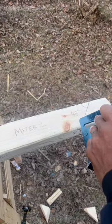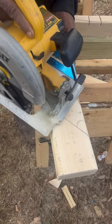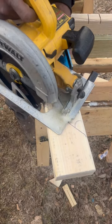Now look right here. Come over here, let's cut this 45. I'm going to use my speed square to cut this 45. I got a 45 right here and a 90 right here on the edge. I'm just going to put my saw right here and use my speed square as a guide. Start it up away from the lumber.